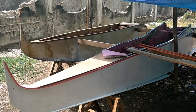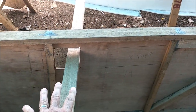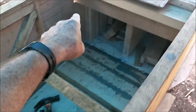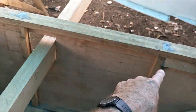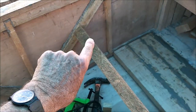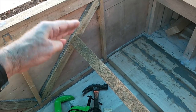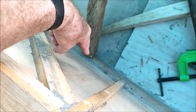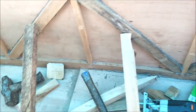We will be back with more epoxying and nailing all of the cross bracing in. We got all the center pieces in. We're not doing the front piece yet — in any place where the cross beams go we don't touch just yet. But the center hull we're reinforcing all of it right now. You can see we got it braced so it's pushing the wood against the side so it's closed and not gapped, because some of this wood is a little bowed. We brace them across here and against the bottom up to the rail, and after you nail them they stay pretty good, but we're doing this until the epoxy dries just to play it safe.